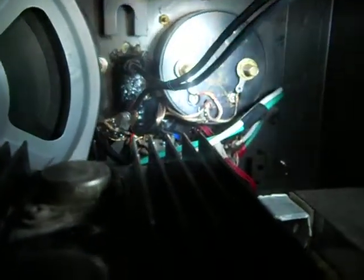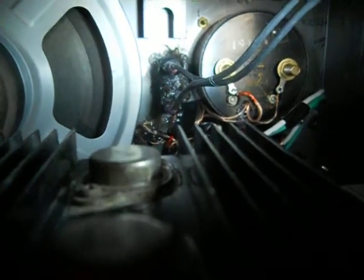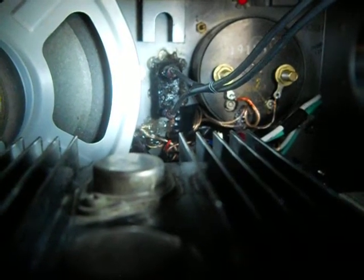So we're down to the AC, the transformer. There's the switch. Excuse the sloppy-looking purple glue in there, but it works. There's a mess of wires in there. I have my speaker knob in there, the binding post, and there's the decibel meter. I have glue and electrical tape around everything around that switch. That switch up in there with the two black wires is your AC on-off switch that goes right to the AC line of the transformer. There's tape and glue around there — it's totally insulated and isolated. That's a danger item; you don't want that touching anything.